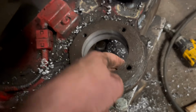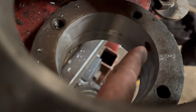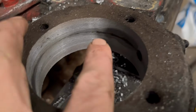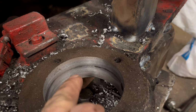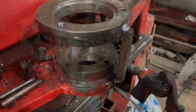Right, so I've got the bottom one bored through now. I've got the bar taken out and the top bearing taken off. I've cleaned in there a little bit where it didn't quite cut it all out with a die grinder. What I'll do now is take the grease nipples out, clean out them grease holes, one in the bottom. Then I think I'll warm all this lot up, because you can see where the two plates are joined together. There's big grease all stuck in between there, so if I warm it up it should hopefully melt all the grease out, and then when I weld it up, the grease shouldn't interfere with the weld too much. Probably won't weld over that bit very well, but the same with the top one. I'll give that a warm up, see if I can get all the grease out, and nice bit of preheat before I start welding it as well.